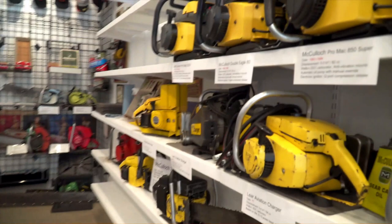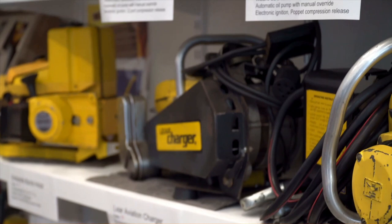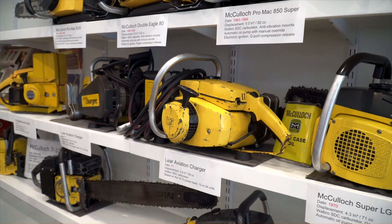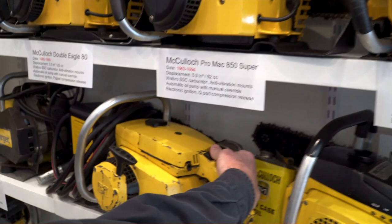The Lear charger — the back story is that Lear Aviation Corporation, who put that package together and sold it, had 24-volt electrical systems on their jets. Some small fixed-base operations where the planes would land wouldn't have a 24-volt charging system available. So they bought the 1010 powerhead — it is a 1010, not a 70 or a Pro-Max 70 like some people think — and equipped it with an alternator. This one has the 12 and 24-volt switch so you can go between 12 and 24, and a throttle lock. Some of them just had a pin you'd pull and insert to lock the throttle at running speed.